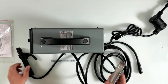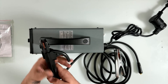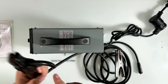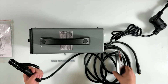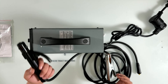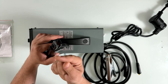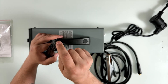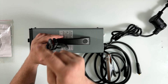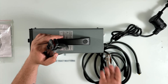Here's how it works: you put the rod — the stick — in the holder, and then electricity flows from here, through the rod, and to the ground on the other side. If you don't put the ground clamp, you're not closing the circuit. The rods have a metal core inside with flux on the outer side. While the metal inside melts with your base metal, the flux melts around it to protect the weld from the elements — that's actually a beautiful thing.